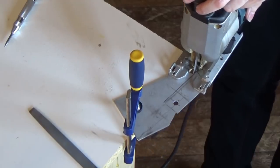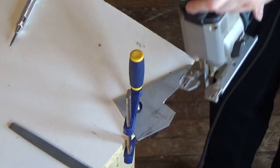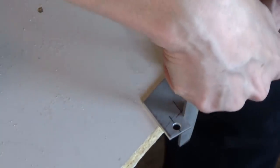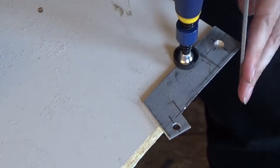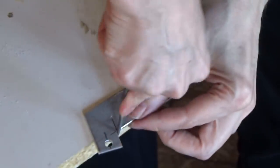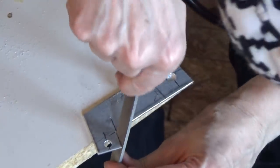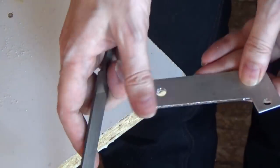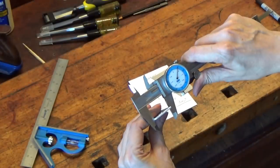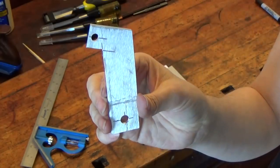Back to the sawing — a few last cuts to release the piece from the plate. Then I've got to do a lot of filing, just filing to shape to get the right tolerance. I've taken measurements so I know the sizing I need. I'm also using a round file on the interior to make sure there's no sharp edge in there that could propagate out from flexing — you don't want the plate to snap from metal fatigue, which you can get if you have a sharp angle on the interior. Last check of the measurements for tolerance, and everything looks okay.